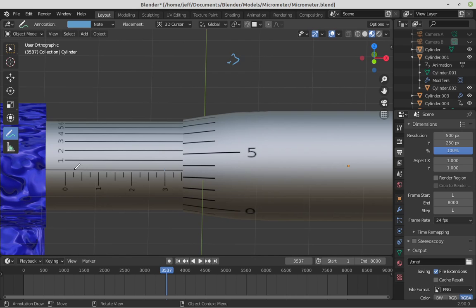The next reading you'd want to do is, well, since these are tenths, and you can see we're splitting the tenths into individual fourths, each of these readings would end up being a 40th. So off the tenths scale, our reading would be 0.3. Off the 40th scale, that's the next kind of reading. Well, this would be 1/40th, this would be 2/40ths, this would be 3/40ths.